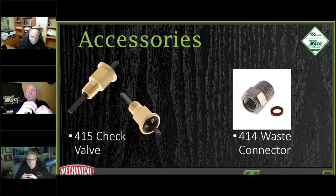Now this is probably more opinion than anything. Me personally, if you had a brand new system, just installed, new boiler, major surgery that happened to your hydronic system, I would keep that vent cap open.